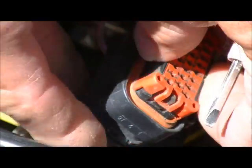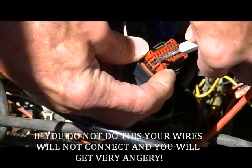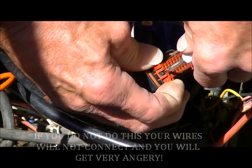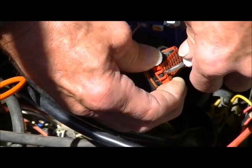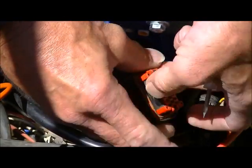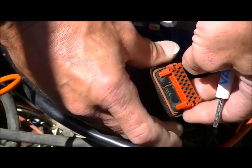To open the shell so you can insert the two pins, grasp the connector by the two red ears, gently prying and pulling on the red connector, turning it over and repeating the process until it pops open.